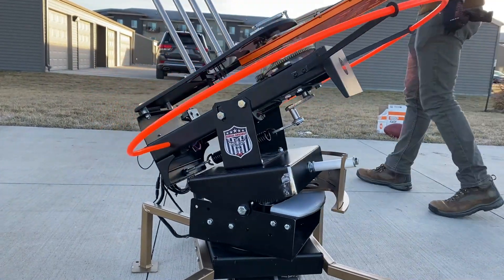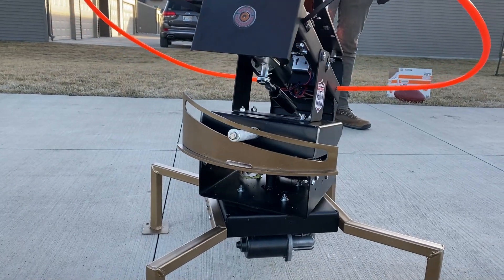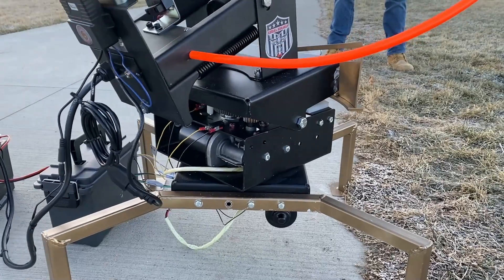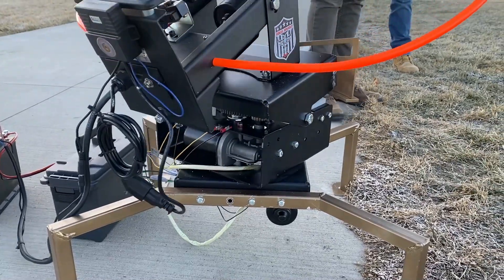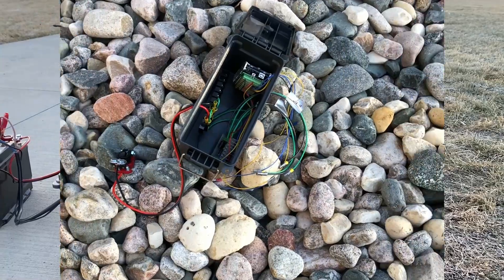Vertical motion is controlled by an arm which has a slot for a peg connected to the topmost plate of the wobbler body. The second motor turns a gear attached to this arm causing the arm to move side to side, subsequently raising and lowering the thrower mounting plate, allowing for higher or lower throws of clay targets.